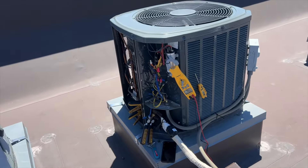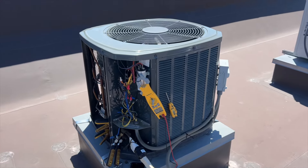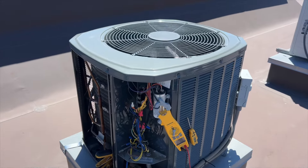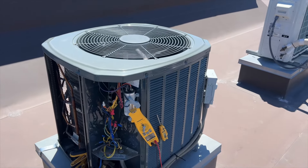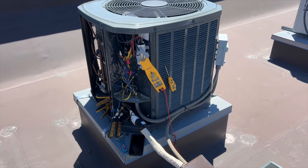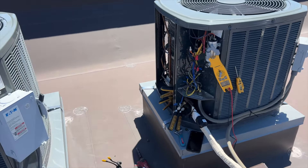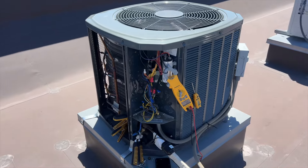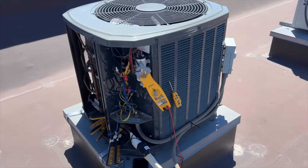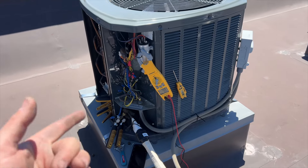I'm going to go ahead and quote them for the OEM controller. The other thing was they asked if there was a cheaper option — that's what they got, and it only lasted about a year. Hopefully this helps you out. Whenever you're dealing with a low ambient control or a head pressure controller, it's good to bypass it and check your charge first, then verify if it's actually cutting in and cutting out properly. This one was supposed to cut in at 400 psi and as you saw it definitely passed that, so it's not working.